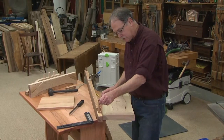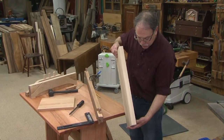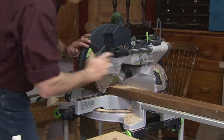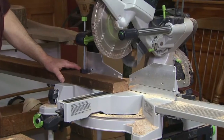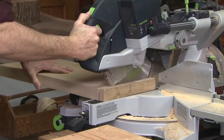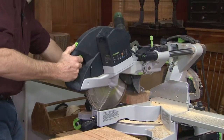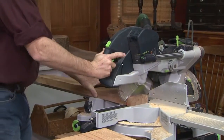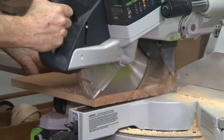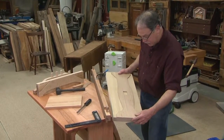A little bit of sanding on the tusk — that is a perfect fit right there, and that will wedge against the two posts. Here's the post pattern, on inch-and-a-half thick material. Earlier at the miter saw I used it to cross-cut all the work pieces to square finished lengths: the long stretchers are 57 inches end to end; the post cross-cut square is 24 inches long, 11 inches wide; the bottom foot needs to be 24 inches long and four and seven-eighths inches wide on inch-and-a-half stock; and the brace that holds the leaf up is a finished length of 12 inches.